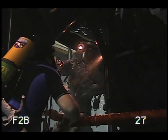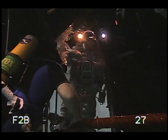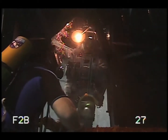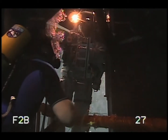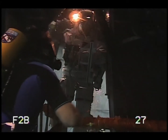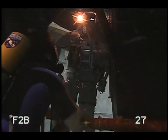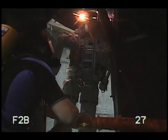This is the fastener capture plate, and the key feature is it has plexiglass windows, and over each screw is a hole. The hole is big enough that a screwdriver can fit through it, but just barely, but not so big that a screw can come out through it. So I'm going to release all the screws, and they're going to float around in these windows and won't come out on the telescope.